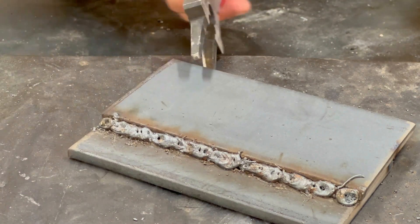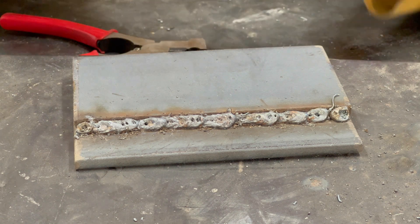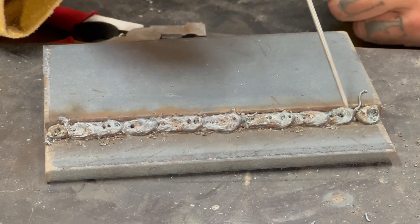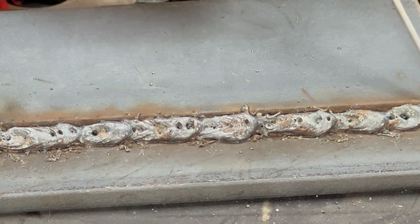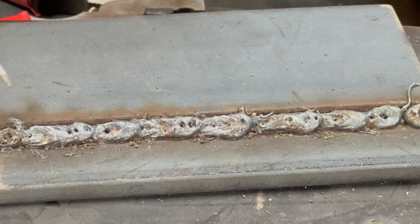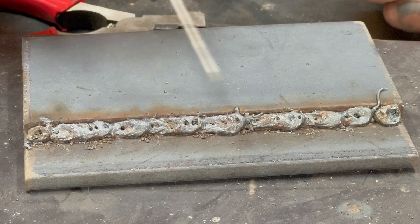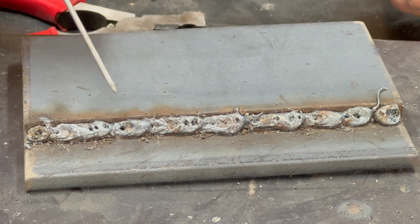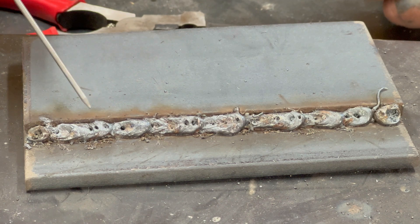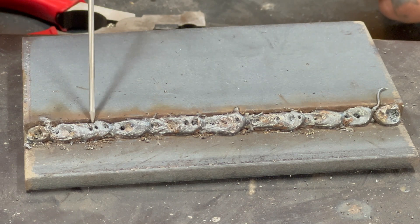Now let's flip it over and take a look at our side where we didn't use the backing gas — and it's a nightmare. Here you can see how the weld is sort of collapsed in on itself; it's very lumpy. There's spatter all over. I did wire brush this one but it was very brown when I was finished. You can see that this is just not a quality weld — this isn't going to be holding anything together at all. When you start to see stuff like this, you know inherently that you have some sort of an issue with your gas. Maybe the line's kinked, maybe your tank is dry, maybe your pieces are filthy. This is an obvious clue that something is not running right with your machine — it's way too dirty.